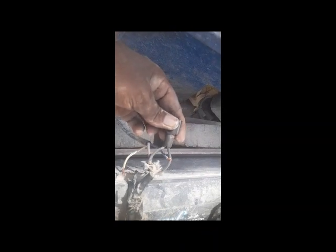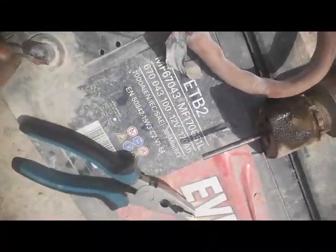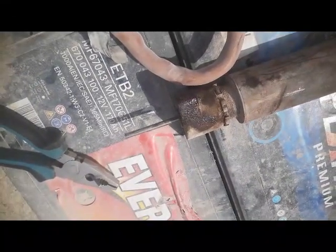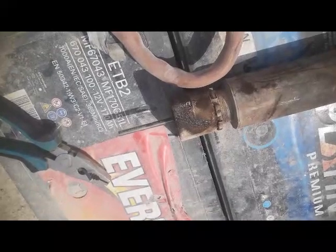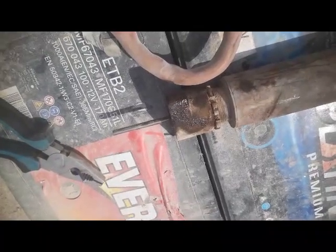After removing these two bolts, we can remove the shut-off solenoid. I've opened this bracket and now I'm going to remove it. I will test it through the battery to check if it's working or not. I give the connections — one wire is fixed permanently and another I'll touch here. You can see it goes back by spring, and when I remove the wire the power is gone.